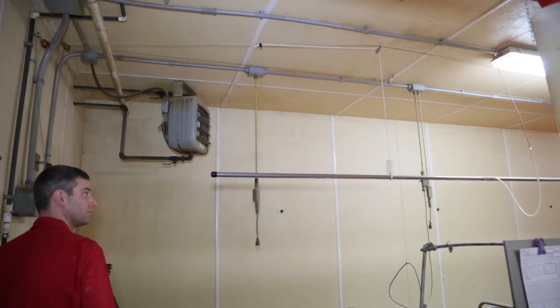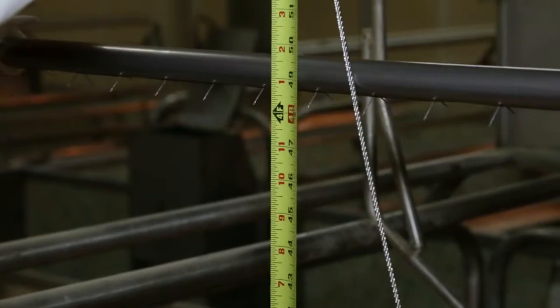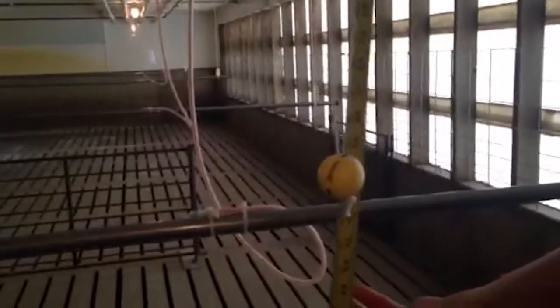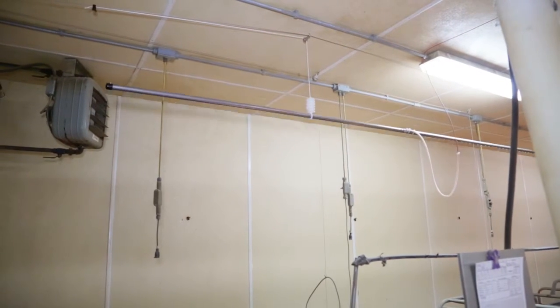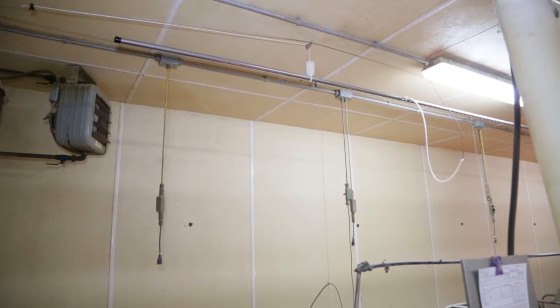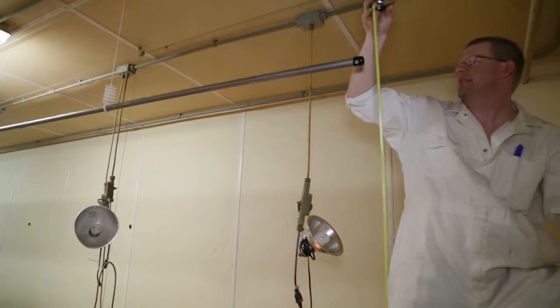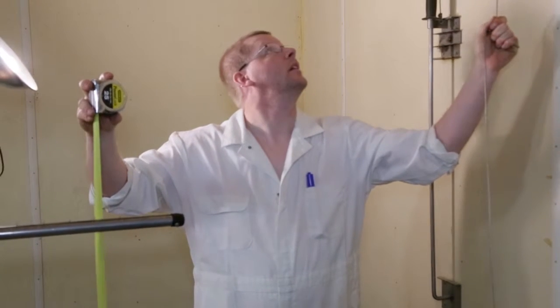Test the lift winch by running the lines up and down to their maximum. Motion must be smooth and easy. Adjust the lines so they are all level and reach the same height at once. Once all the lines are level, use a hanging ball to mark 50 inches above the floor. Hang the ball from a rope attached to the ceiling — the ball should be approximately 6 inches from the corona pipe. During operation, the corona pipe should be just below the ball level. To gain maximum vertical clearance, if the corona pipe is pulled all the way up to the ceiling, make sure the pipe insulators are not touching the pulleys, as this will prevent damage during use. When all pipe insulators are touching the support pulleys, the corona pipe runs are adjusted to maximum height and each corona pipeline will move in unison.